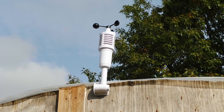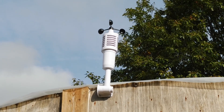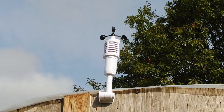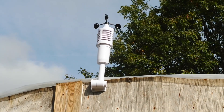Here's where I've got it mounted now. We've got a very light wind today and the anemometer is turning. I took the old one down while I was up there and discovered why it didn't turn anymore — the bearings froze up in it. It is 10 years old, so I'll probably just scrap it, but I'll still have a play with it.